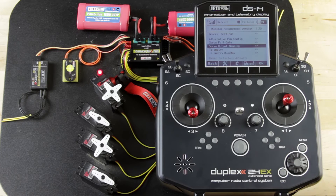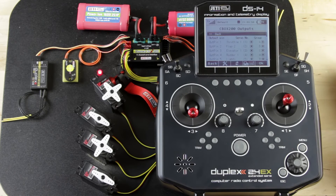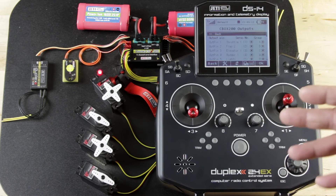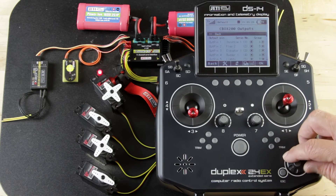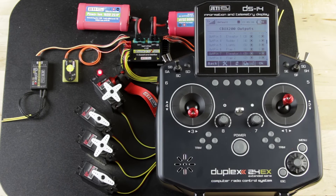Servo Output Mapping is just like what you've done in servo assignment under your standard setup menu under the model setup assignment. This will allow you — no matter what your servo assignment is in the radio — to arrange the pins the way they fit best in the unit once it's built into the aircraft. So if your servo assignment says channel one is aileron but channel one won't physically reach aileron, you just reassign that to the best fitting pin, making sure you match that here to what's physically plugged into the central box. Then you can make changes as you see fit or add and subtract things as you need to.